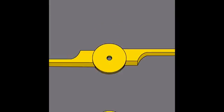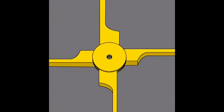Each arm would have a thin disc soldered to the end. These discs could meet and stack at the top of the crown. These discs would be roughly a quarter of the thickness of each of the arms and would be attached to the mount at staggering intervals. Staggering the point of attachment of each of the discs to its respective arm meant that once the 4 arms met at the top of the crown, each disc would be locked in place by the 3 overlapping arms.